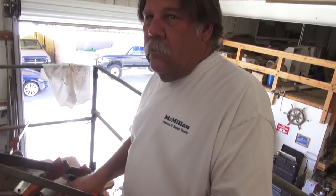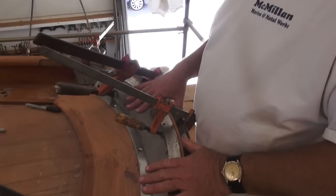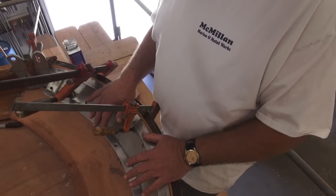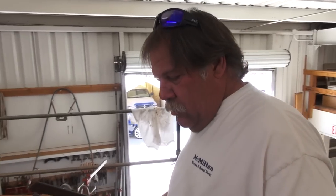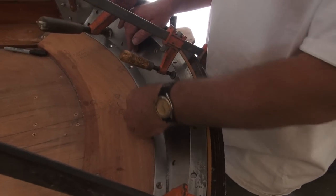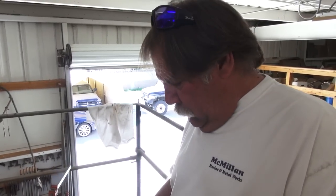And it was all kind of bent, and it had been designed for a different configuration. It had some corrosion issues down here at the bottom. And it also needed to be re-elevated because Doug, in the process of rebuilding this section of the boat, changed the elevation of this. So this had to be reworked and resurfaced basically. How far off was it from being flat and straight? About three-eighths of an inch.